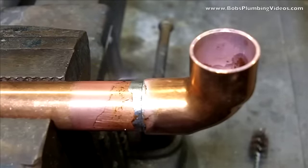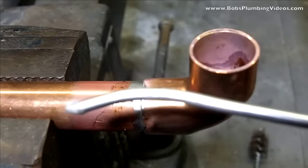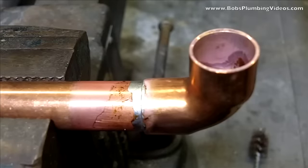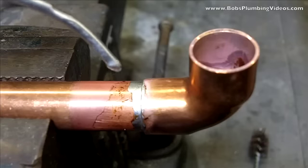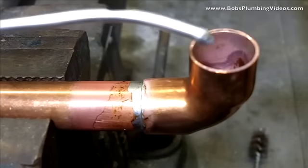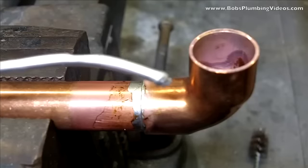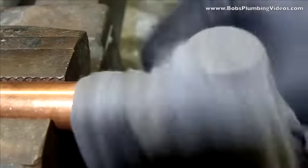That was fast and I didn't use a lot of solder — that's absolutely correct. I used approximately a half inch in length of solder. I often see guys continually feeding solder in while it's pouring out the bottom, which is unnecessary. You need a half inch of solder for half-inch tubing, three-quarters of an inch for three-quarter-inch tubing, one inch for one-inch tubing, and so on up the scale. That's all you need to fill the cavity — no need to waste solder.